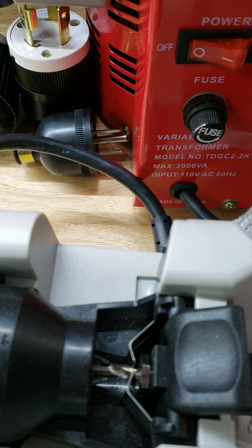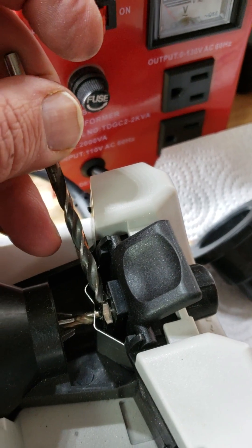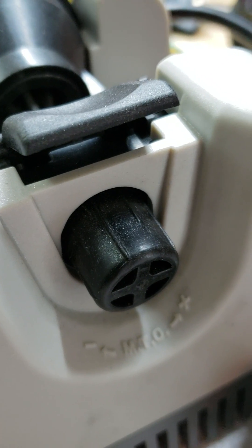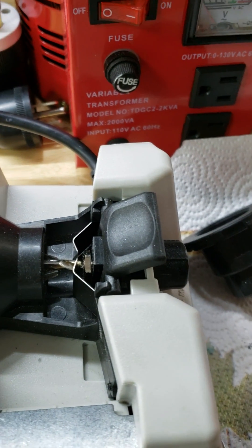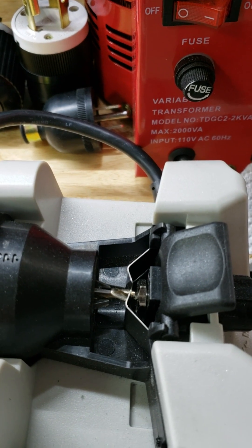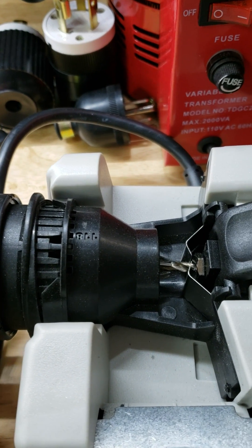The other thing I found out: you see this stopper right here — it's actually a bolt. You adjust it with this knob. Plus means a more aggressive cut that takes off more material; minus means the opposite. I had mine set to the most aggressive, and that was the wrong move because it takes off the point — you don't want that. So I backed it off a couple of turns. There's only a really small gap between the black stop and the bolt.